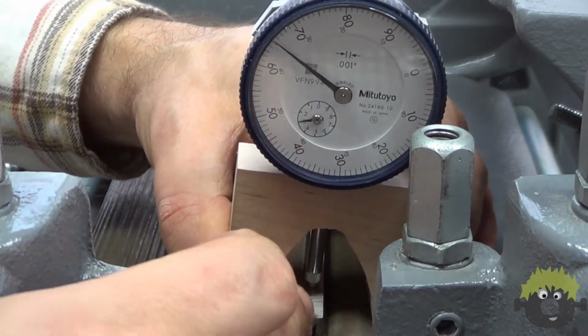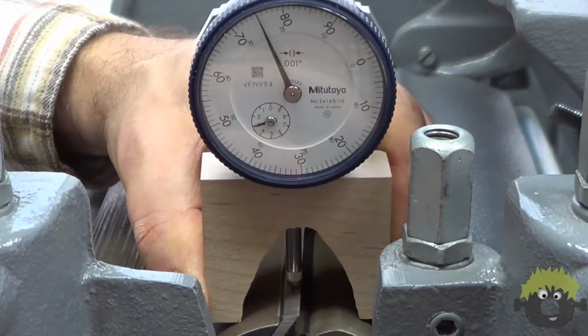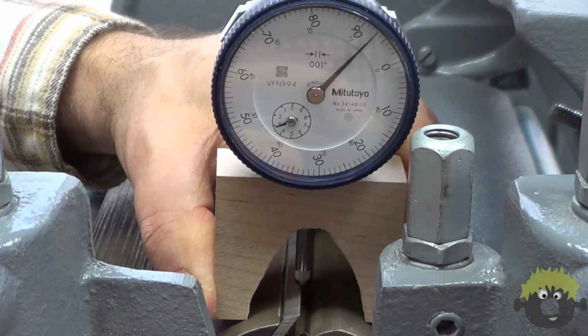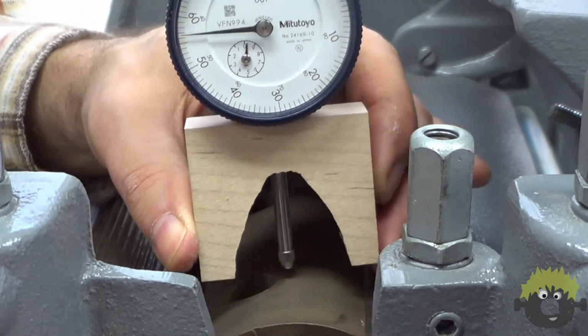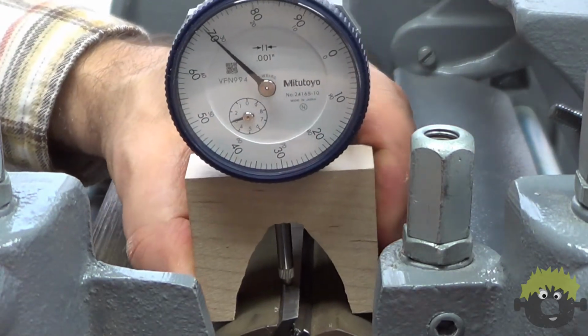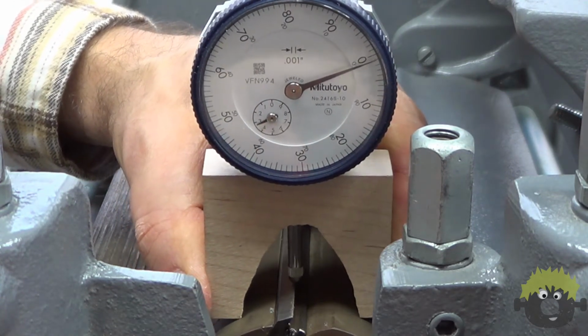For me, I decided that this error rate was too high, so I defaulted back to the tried and true, albeit slower way to get the knives set. I also found that the indicator holder that I had cut from 3/4 inch material was a little bit wobbly, so I made a new one out of some 8/4 maple that would provide better stability.